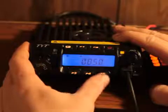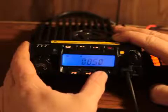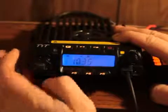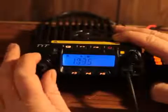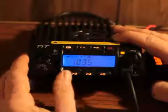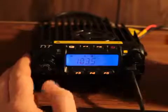To set our tone, press the P5 button repeatedly until you see the T come up. You see it — 103.5 — and there's a little T in the very top center. Take it to 103.5 and press any key to get out.